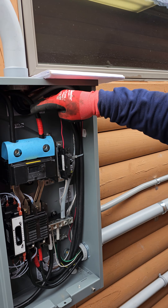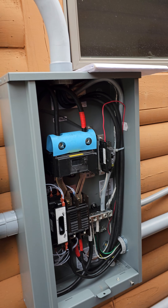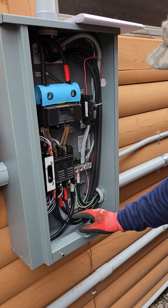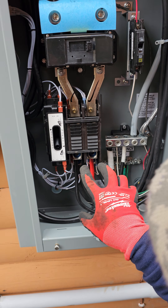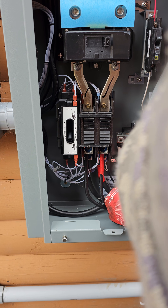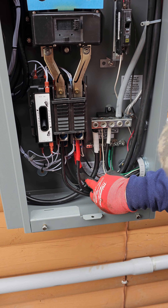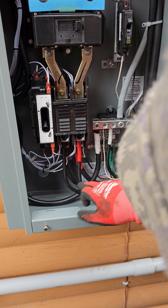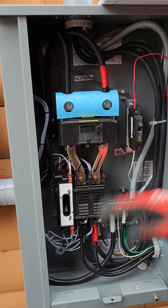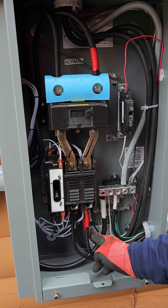You've got your two hots, then your neutral, then your ground coming down here. On your generator side, it's the two lugs out front of the generator — you've got your two hots, a ground, and a neutral. Then these back two are your customer's load, which is also 200 amp wire, and the transfer switch switches from the generator side to the customer load side.